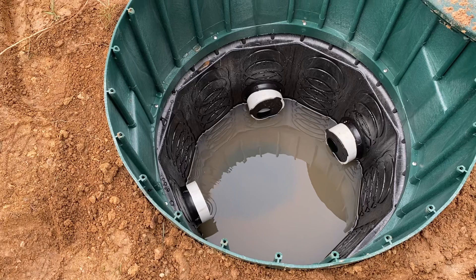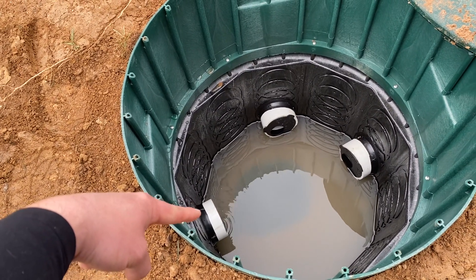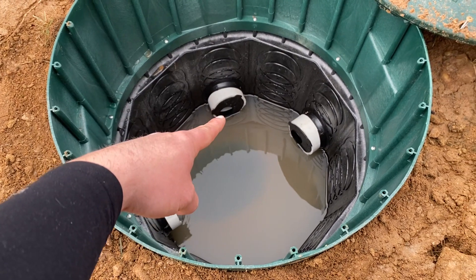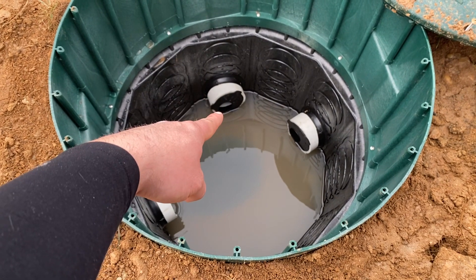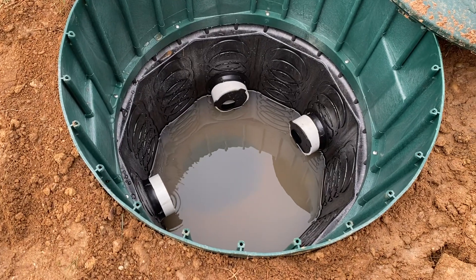The way this works, you're going to have the water from the tank come in through here. It will then go into the pit and you'll have the water go into the drain lines which you can see right here. These speed levelers are basically a hockey puck with a hole in it that you rotate to get a nice even distribution of water in the system.